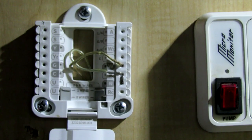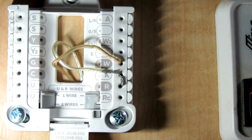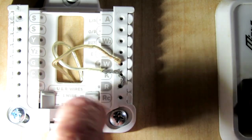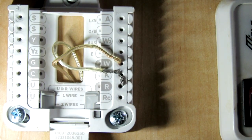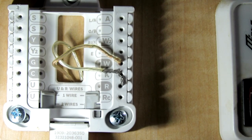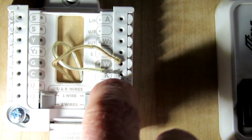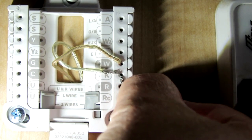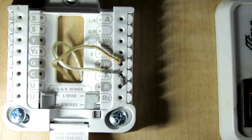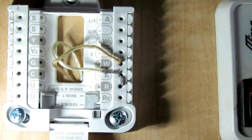Because of that, I wasn't certain on how to actually wire it. If you look on the very bottom, there's a little switch that you can toggle up or down — whether it says one wire or two wires. I've got it on the one-wire setting, which I had to learn the hard way. The wires just push inside these little connectors; you pull the toggle back and it holds the wire in. It's wired between the R and the W. Simple as that.